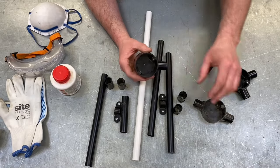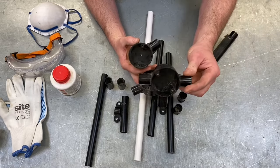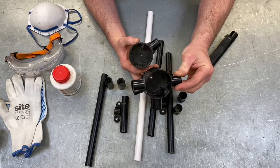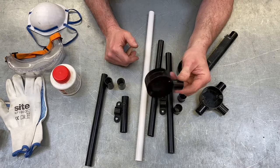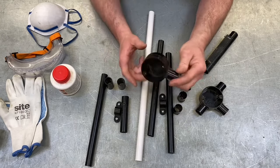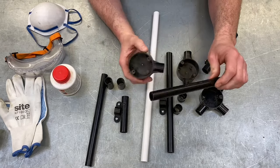Boxes are very similar to those in steel conduit. As an example of three: we have a 20mm black PVC tee box, a through box, and one often called an end box but usually called a termination or terminal box. To secure conduit into these, you cut clean, square the ends at the right length, and push them into place.